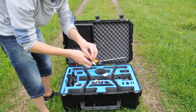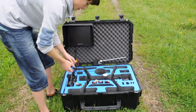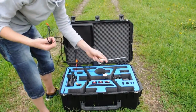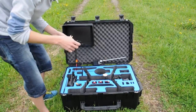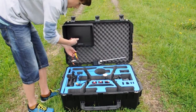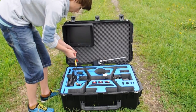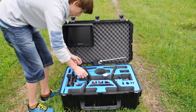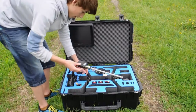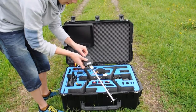You can see I have one with all those cinch adapters and the power plug. On the other side you'll find this 6-pin connector — that's for the goggles. But today I'm not going to fly on the goggles, so I'm going to take the other cable which has a power cable, a JST connector, and the cinch. We're going to plug those in: the yellow cinch goes onto the yellow cinch on the screen, plug in the JST the right way, then give this guy some power. We're also going to plug in this 3-pin 3.5mm jack into the AV out of the transmitter.